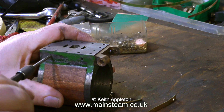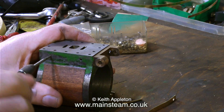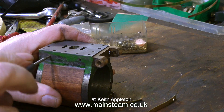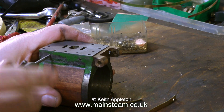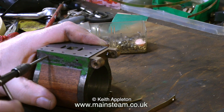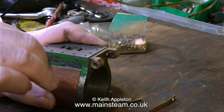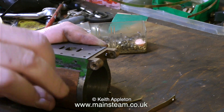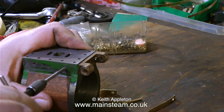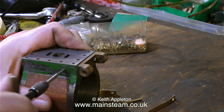If you look on the bench you'll see two pieces of boiler banding with holes drilled in them — the secret is to drill holes in both ends of the boiler banding. This shot shows me tapping two 6BA holes in one side of the cylinder only. I'm not going to tap the other side until I've fitted the boiler banding to this side. Then the banding goes around the cylinder and I can see where the holes end up at the other side. Don't forget they need to be half an inch in from the end of the cylinder and definitely avoiding studs. I did check this first, so everything should be fine.